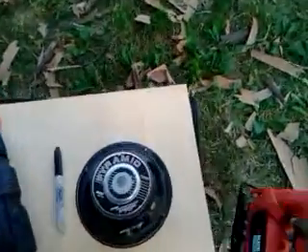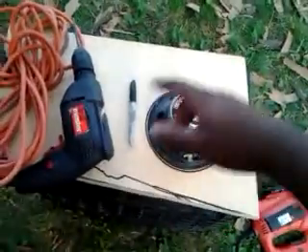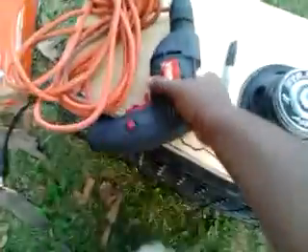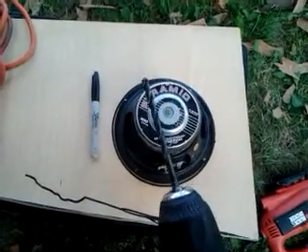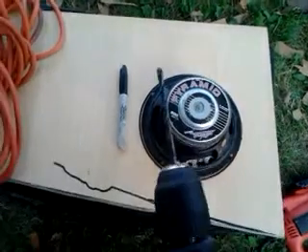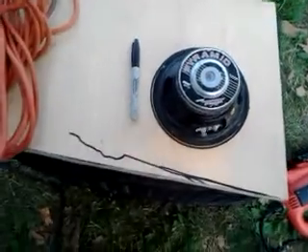Let me get back to this. This is one of the tools you're going to need — you're going to need a jigsaw. Some people prefer a router because it makes neater circles. Then you're going to need a drill with a bit on it. Now this is not the bit I would use. You got to use a bit a little bigger than the actual hole that you're going to cut, so that way you can get the jigsaw blade into the hole to start cutting your circle.